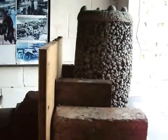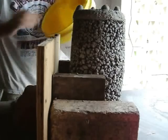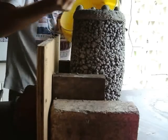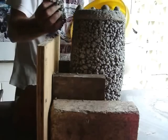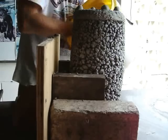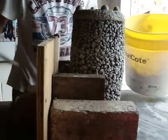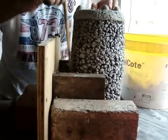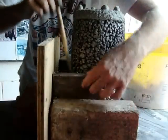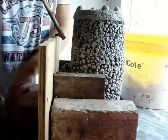Here's the mix — I'm just going to finish this off here. Just drop that down there and make a bit of a form up. Just tamp it down as you go. Make sure the form doesn't move. You can nail this together if you like. I'll just put some bricks here.